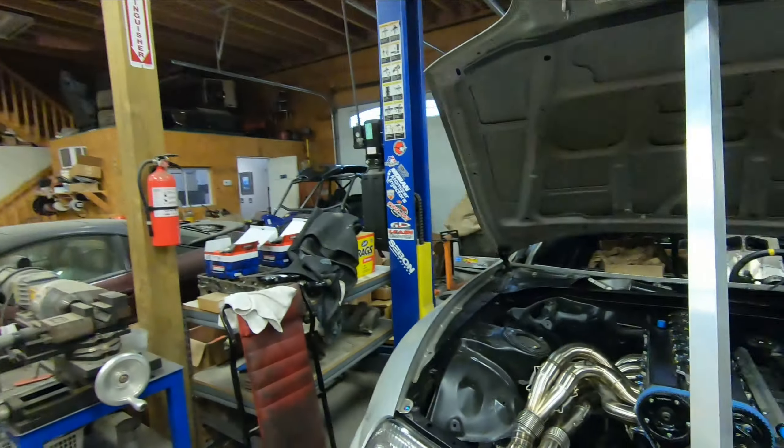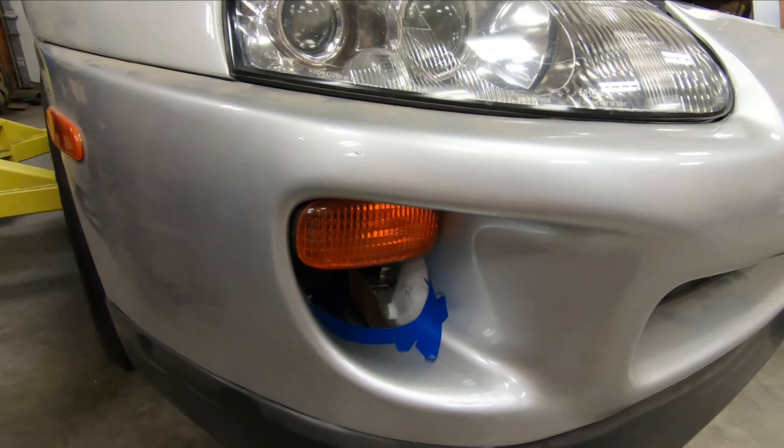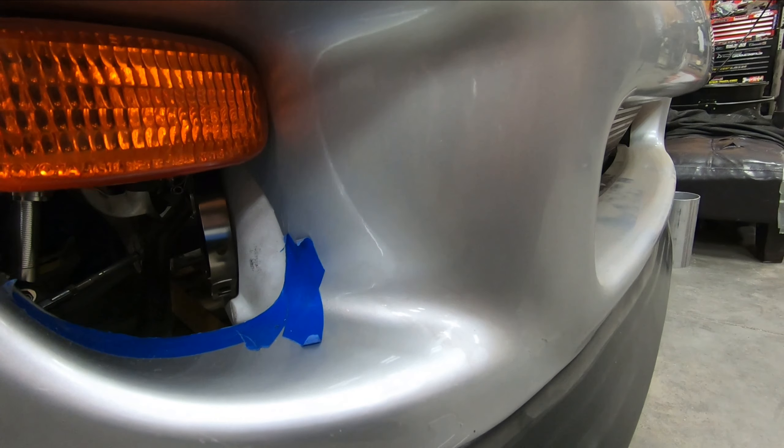So I put the factory body panels back on it and took the titanium exhaust off, as well as having notched the engine plate, as I do plan to run a full exhaust on it. It will be semi-complicated to get the downpipe done, but I have it designed so I won't have to reduce tubing size from 5-inch to something smaller and restrict the turbo or cause a back pressure issue. I trimmed a little bit of the bumper and some more needs to be trimmed to get it farther away from the turbine housing.